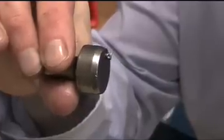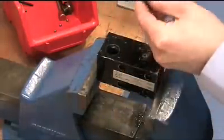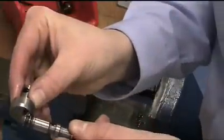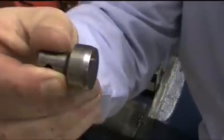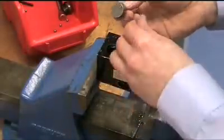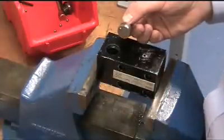I'll remove the valve spool and show you how those two components engage. That's the valve spool that sits inside the valve body — that grommet should sit inside the groove on the valve spool like so, so that as the lever rotates it pulls the valve spool back, and rotating in the opposite direction pushes it forward. Because the grommet has sheared off, we're not getting the level of contact required to move the valve spool. Unfortunately we don't have a replacement for that part at the moment, so we can't repair the fault right now. Ideally we'd replace this component to restore sufficient interference with the groove on the valve spool.